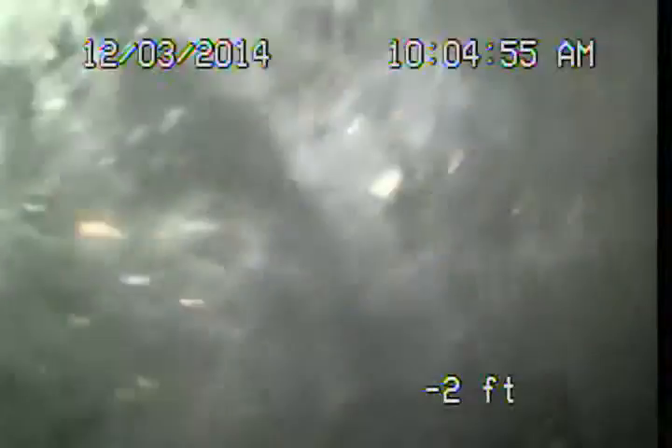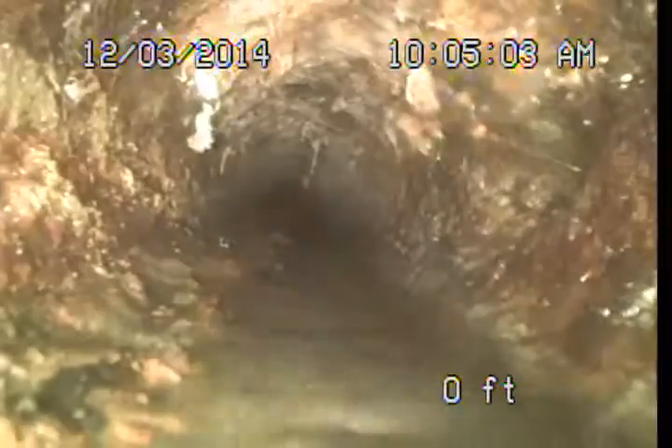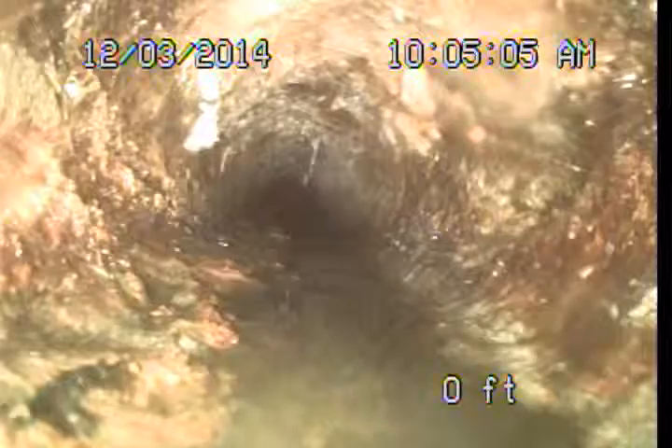You'll see here are all these turns right as you drop in — drop downward, back to the left, back to the right right away before you get into that cast iron. I'm going to track the line a little more to see if we can find a reasonable spot to recommend a clean out for the cleaning.